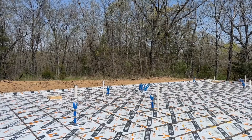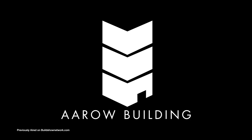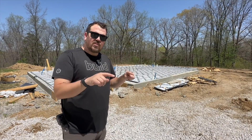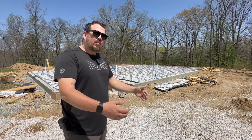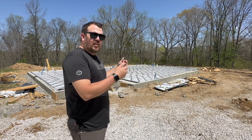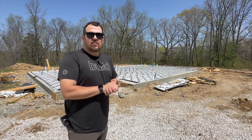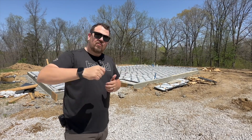Today we are on one of our projects and we want to talk about this insulated concrete slab. If you remember our New Prairie Arrow project, we've talked about how we have a turndown slab that is insulated on the top side. That allows for our insulation control layer to be continuous. Two layers of subfloor, and now we have a warm, soft-feeling floor that will accept hardwood, and we have a perimeter wall that bears all of the structure of the building, so we have no interior bearing walls. If not, go back and watch that — we published a video on that recently.